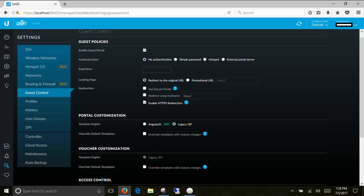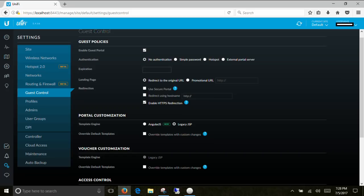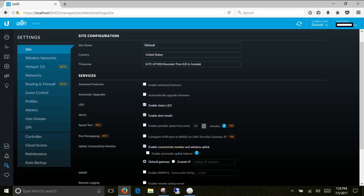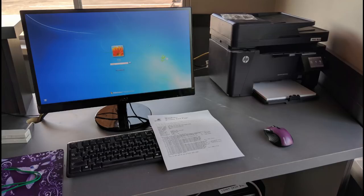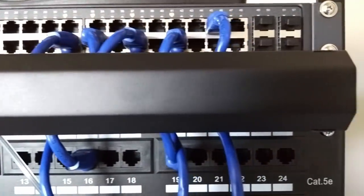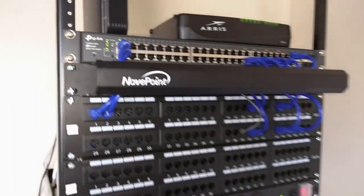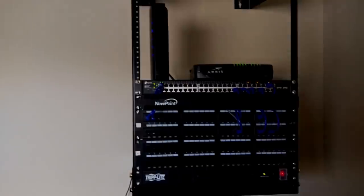Next we will be setting up the wireless access point. I will be disabling the one that comes with the ISP combo unit and instead using the Ubiquiti UniFi AC Pro wireless access point. I've already pre-configured this at home and won't go into that detail here, but I'll be doing a separate review of it in an upcoming video. This thing is pretty nice. I can plug the access point into any port in the building, go to the patch panel, activate that port, and we're good. This access point also allows guest Wi-Fi with a landing page and terms to accept. The software is pretty awesome too — you can monitor performance, allow and disallow services, manage multiple access points, create a physical layout or map of the access points for coverage, check usage of specific devices, and much more. All that is left is to set up the PC equipment and activate their respective ports. That's pretty much all I wanted to cover — if you have any questions, ask in the comments. If it was helpful, like it. Thanks for watching.